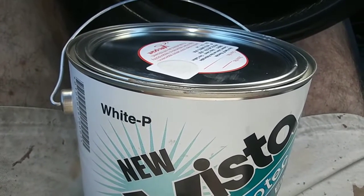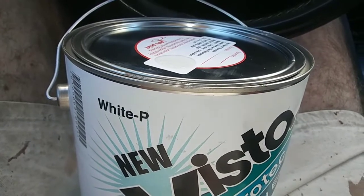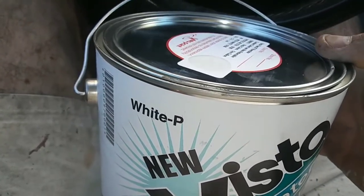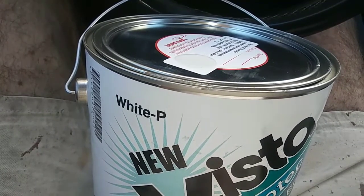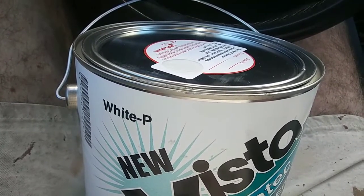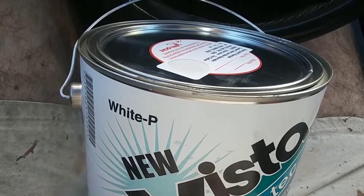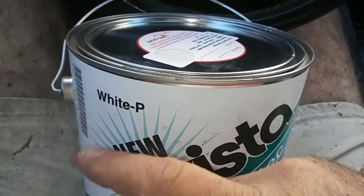Would you accept something that looks pure white but won't get so dirty and be so hard to manage? That's what I explain to them, and 99 percent of the time they cave. If you have to use white and want it to cover, add KX - KX is pure white tint. Typically I'll have them put in two to four ounces of KX. If I'm at Home Depot buying Ultra Pure White from Behr, I'd have them add KX, which gives it more titanium dioxide to cover better in one coat.